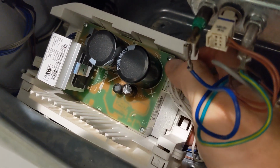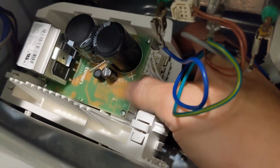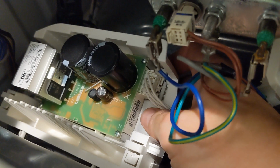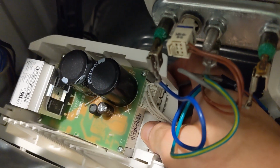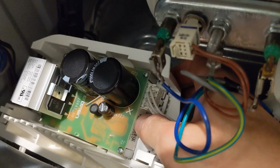There's 4 screws right there, 1, 2, and you see on the other side right there, there's a little spring mechanism between this. It's got this board right here, there's a board underneath it. There's little solder pads right there, and this little spring device that clamps together actually wore through the solder pads completely. So I ended up reflowing them, not too much because you can have too much compression.